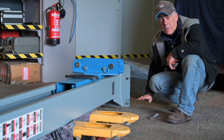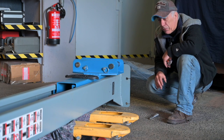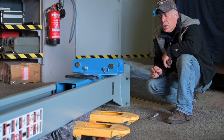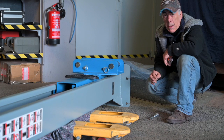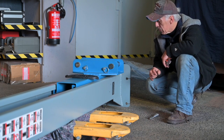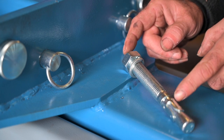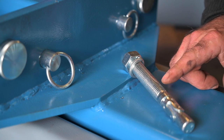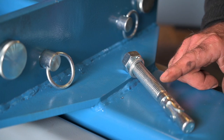The concrete must be flat — you have a tolerance of 0.5 centimeters. You really should consider a good and solid bonding of the foot to the ground. If your concrete slab isn't thick enough, don't take risks — then dig a hole and pour some concrete. In the packet you will find 10 mechanical M18 locking bolts. You need to drill the hole of sufficient depth and then knock them in. I'm going to use a chemical bond instead, which I think is a bit better.